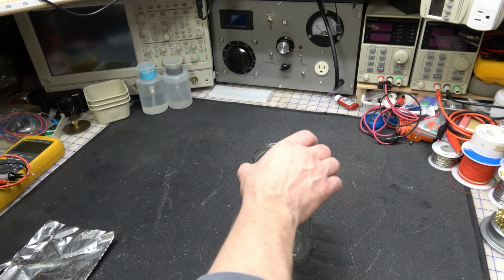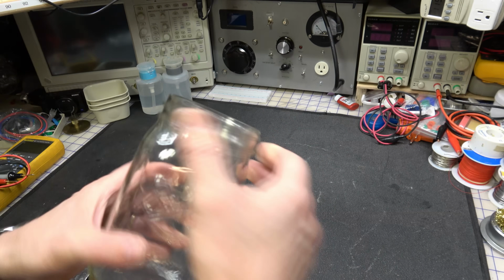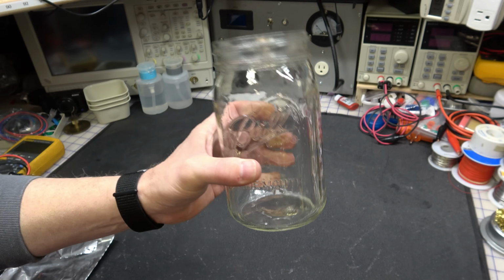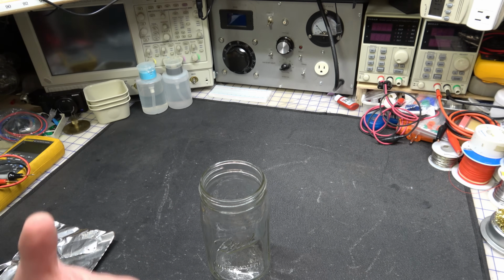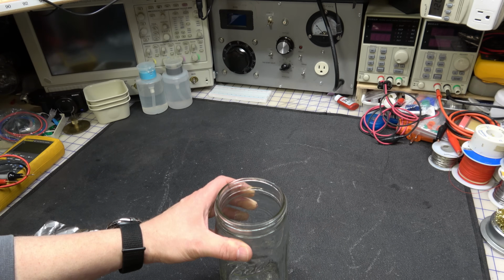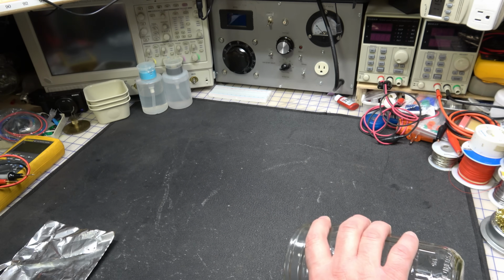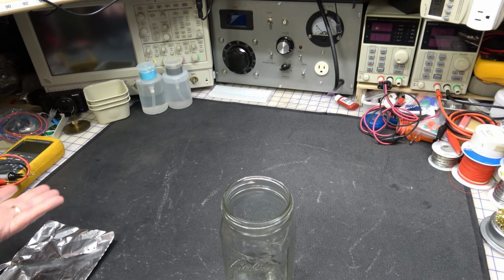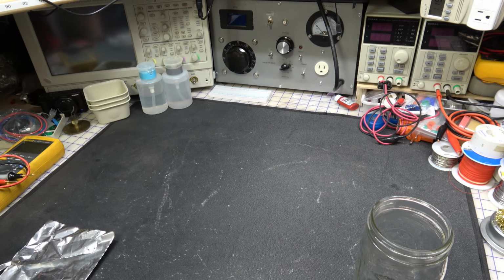And the nice thing is when you're done, you just take the glass out. The tank in your ultrasonic cleaner is still clean, and you're only using up this much chemical. So if you're doing switches or knobs, I'll do that with knobs. I'll take something like Simple Green mixed with water, or Formula 409 cut with some water, some kind of really good degreaser, and I'll drop the radio knobs in there and fill it up with that. Let it clean, and when I'm done, I'll just pour it out in the sink because it's basic household cleaner. I'm not using any kind of caustic chemical, so dump it down a drain, then pour your knobs out onto a paper towel and let them dry. And they look like brand new when they're done.